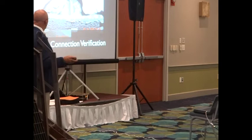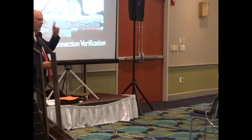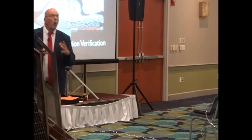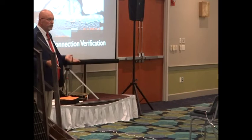Can a whole fire escape collapse? Never. Every 4 feet there's a redundancy. Can a piece of it tilt, drop, or whatever? The answer is yes. That's why you do a pre-load test evaluation. You never load test a fire escape that cannot pass a theoretical load test, meaning every connection has no rust. All the connections are in good condition with either a very tight original square head bolt or a new bolt. If it's got a new bolt, there is no need for a load test at that time because the NFPA said the authority having jurisdiction shall accept by load test or other evidence of strength. As soon as you change the bolt, you're in other evidence of strength plans.